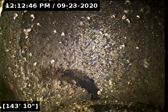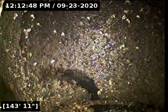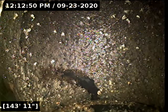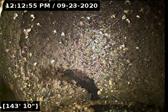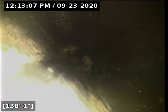Alrighty, we are indeed at the tank. Where I located is, my locator was right up against the tank lid. Right around 3.5 feet deep there. So, again, we've got standing water out here at this point. I put a white X marking there. With the rain we're having today, you're probably going to have to relocate, because these markings are very likely to wash away.